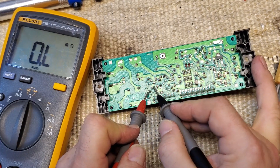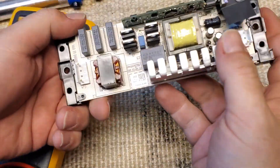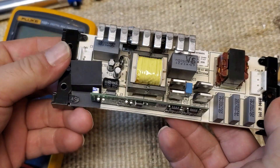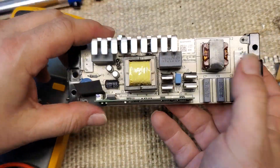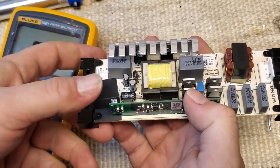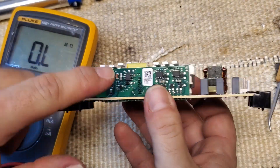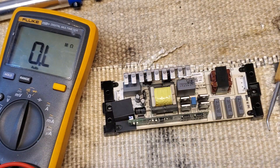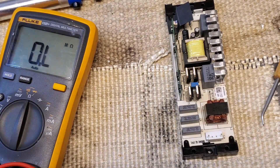It's a nice thing about MOSFETs — when they fail, they tend to just short. Kind of wish they went open, but what are you going to do? So if you need to fix your ballast, if you have one of these PTBI PO3, or even one that's similar, they're all generally the same — just different wattages give you different numbers of transistors and bigger or smaller inductors. The theory applies across the board. Just follow your power input, look for the transistor or MOSFET connected to that power input and start there, or just check all semiconductors. Sometimes they're mounted on a board on the side; if they're surface-mount, that makes it a little more difficult. This ballast will go into my to-be-used pile because it's a good one now. If you have any questions, put them in the comments. If you don't subscribe, think about it. Thank you for watching.